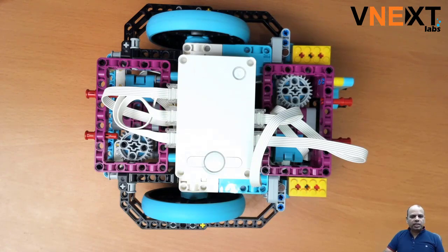What we realized while working with the Spike Prime robot — created using the base kit and expansion kit with large wheels — is that the position of the color sensor is not ideal. It's mounted a little too low; the Lego documentation says it should be at least 1.6 centimeters from the surface, but it's less than a centimeter in the original mount.